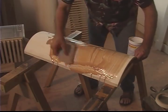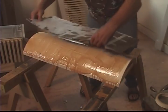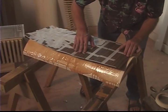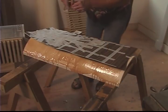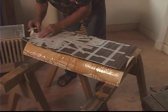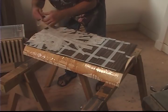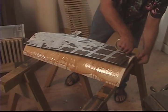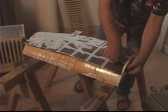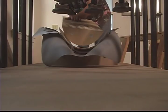The grain direction on the top layer of the plywood is running vertically. Fortunately in this case the prominent grain direction, which is my ebony, runs horizontally. So it in fact cross-bands with the top layer of the plywood panel — this is a good structural situation and will make for a stronger, more stable panel in the end. As I make the picture I'm always working from the back side, the clean side of the panel. I'm putting the glue onto this side of the panel and that's going to make the tape side the front side. So you always have to bear in mind that we're looking at the mirror image of what the final product is.